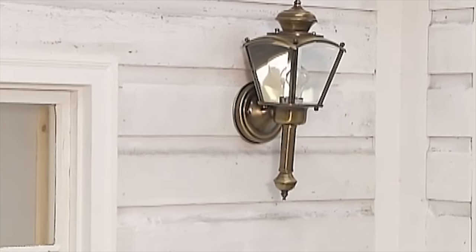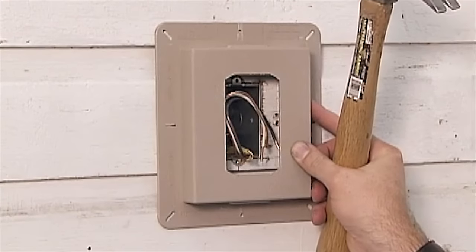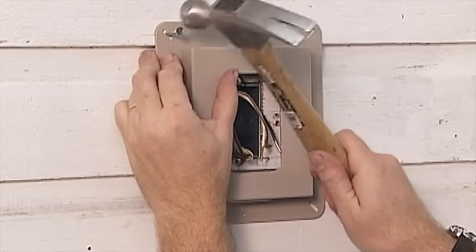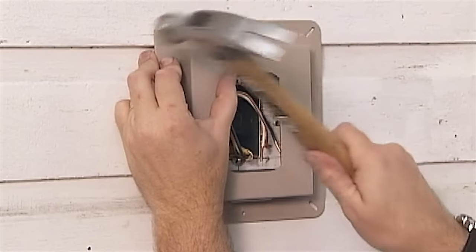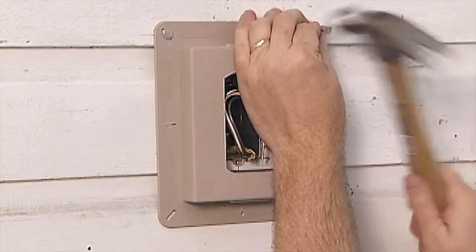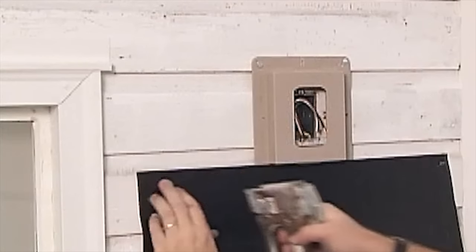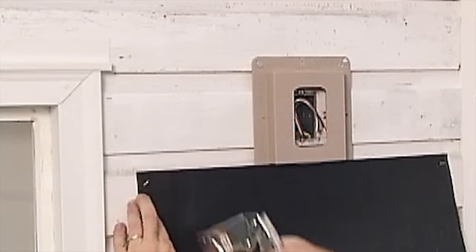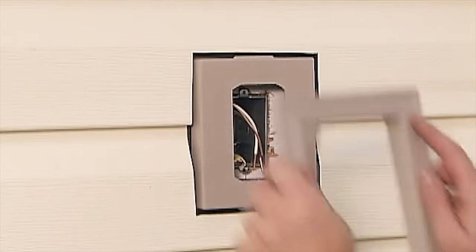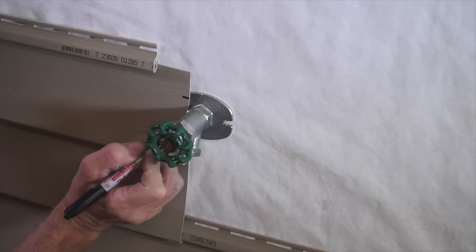Use a commercially available fixture mount to fit siding around fixtures and other penetrations, following the manufacturer's instructions. Most fixtures are removable, and most manufacturers have two-part systems that can be used. Attach the mount base. As with the window opening, install flashing around the mounts to allow for water drainage. After siding has been installed around the base, the fixture mount cover can then be snapped into place. When cutting around the mount base, be sure to leave a 1/4 inch to allow for panel movement.